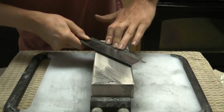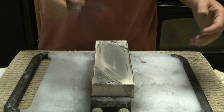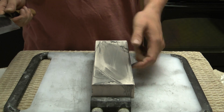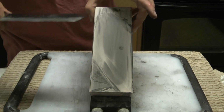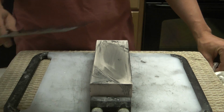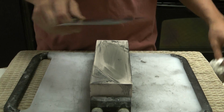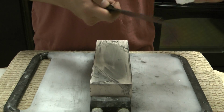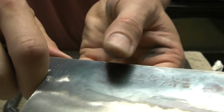Now, I'm very fortunate in a way that the Latte 400 is no longer available, because this is actually an upgrade to the Latte in my opinion. Much thicker stone. It does not dish as fast. It cuts every bit as fast in my opinion. Latte might have been a touch more aggressive. I mean, you're splitting hairs there. This is, and we've reached a burr on the other side, by the way, while I'm talking.